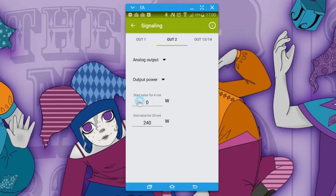Okay, and you can set, this is a 4 to 20 milliamp standard industrial current loop, and this is how you do it. Now, if you were normally running the unit at say 8 amps or less, maybe you only had a 200, you wanted to get the maximum scale for your power monitoring, you might change this, for example, to just read 150 as an example. And now what that's going to do is 20 milliamps is going to represent 150 watts. So if you go over that, you're not going to get any more reading, but you will have better resolution now within the operating range.